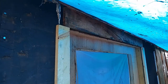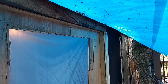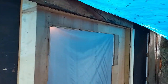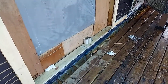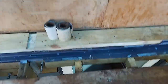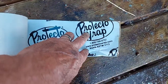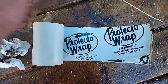The weather has finally broke. We've got the builder board on — it's all secure. We've got the framework on around the outside. Now, in most cases you would not have to do this, but in my case I do because of the vertical siding. I am now getting ready to flash the threshold. I've pulled up the ledger flashing and put some staples in it. I'm going to use some Protecto Wrap, like you would use around a window, to flash this ledger sill, and we'll be in good shape.